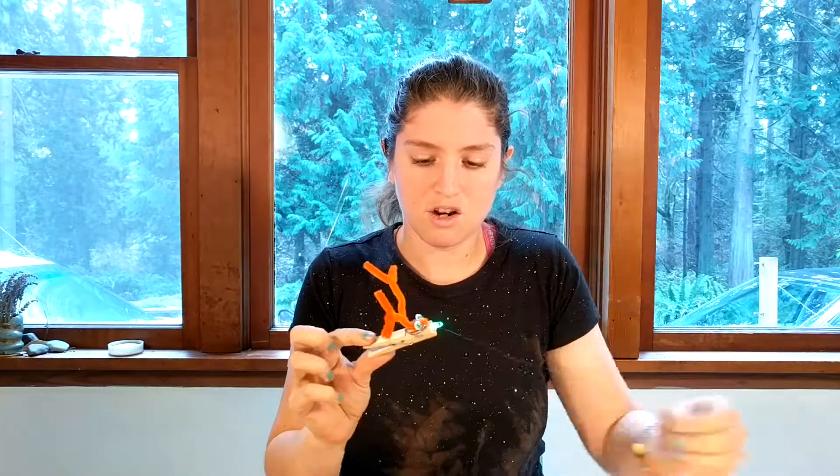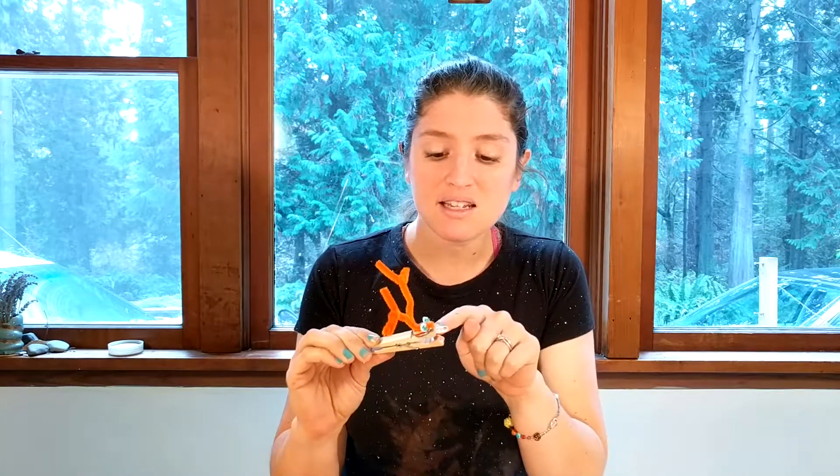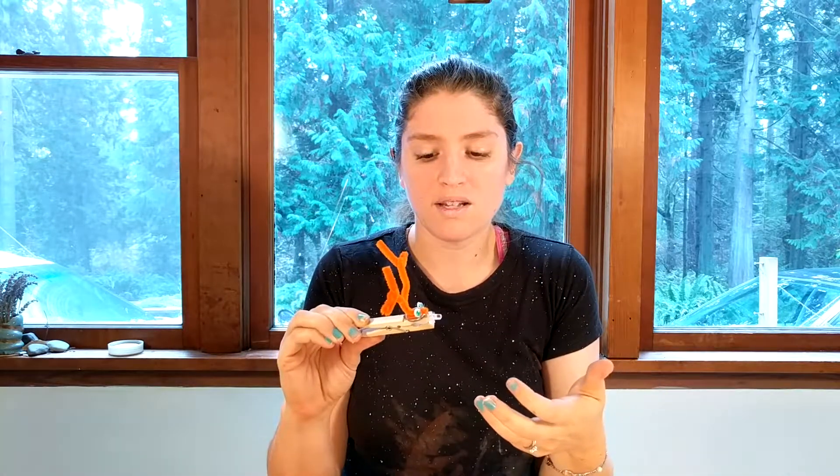When the circuit is an open circuit — remember we talked about how there's going to be a switch in here — the switch is just you opening your circuit. This is great because when you use a light switch, you don't actually get to see how that switch is opening or closing the circuit. Here you do. You see exactly what's happening — my LED is no longer connected to the bottom, the electrons can't go anywhere, nothing is happening. Once I allow current to flow through, I have this light.